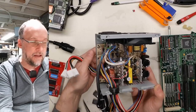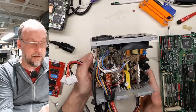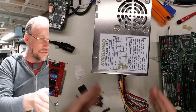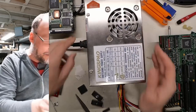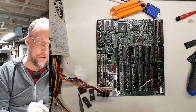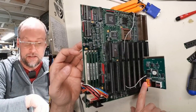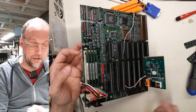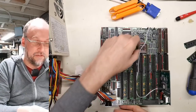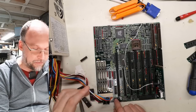The funny thing about this power supply—I've used it a lot and it has automatic shutdown with overcurrent protection. If something happens, like a shorted tantalum on the motherboard, it just shuts off, which is really nice. Fortunately we have another power supply—a King Pow XT supply, probably 150 or 200 watts. With the original chip back in and this supply, the computer no longer does anything—it's not coming out of reset. The reset LED on the POST card needs to go off before code execution, but it's always stuck in reset.